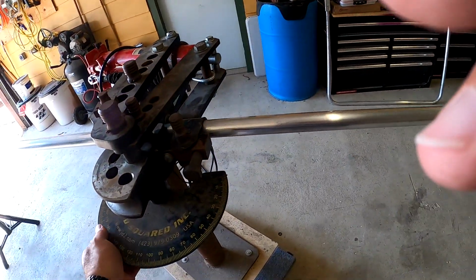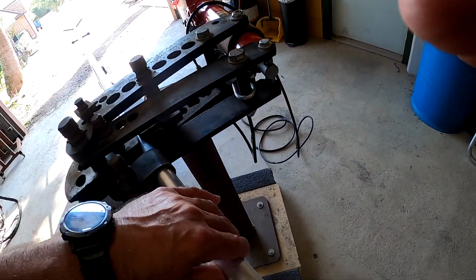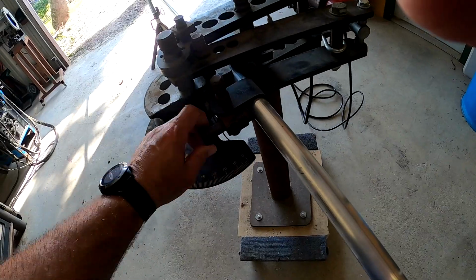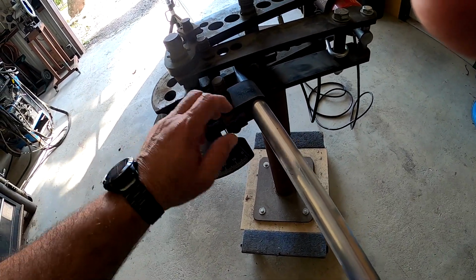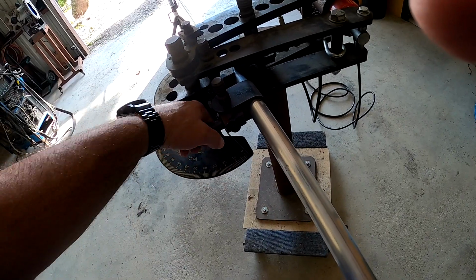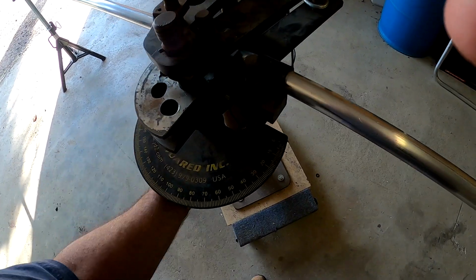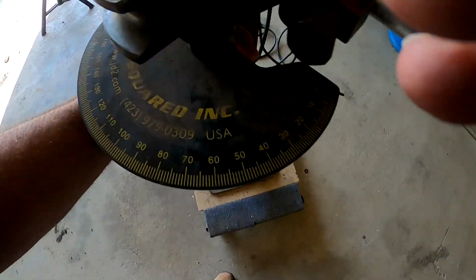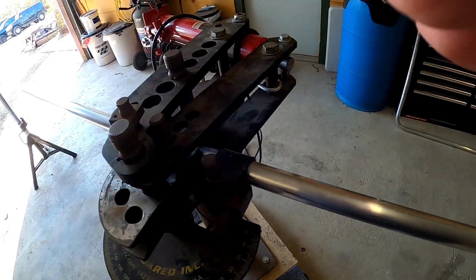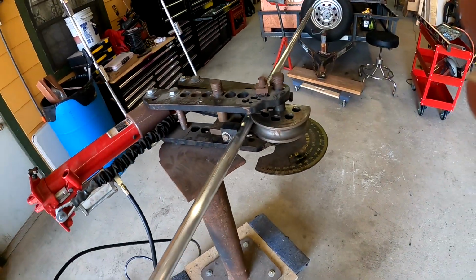And then you set your indicator. You got to pull everything tight. Make sure that this is tight, no slack in it. Put your little jam nut on here. I don't like this part of it because on aluminum, you can't do it real tight because it'll gall it or scratch it up. So then you set your indicator to 0, and then you take off.